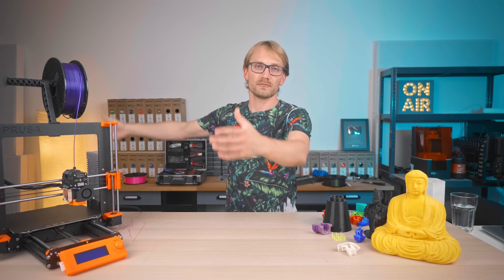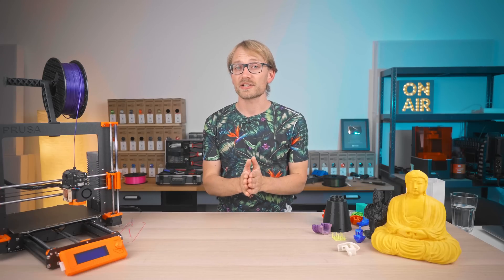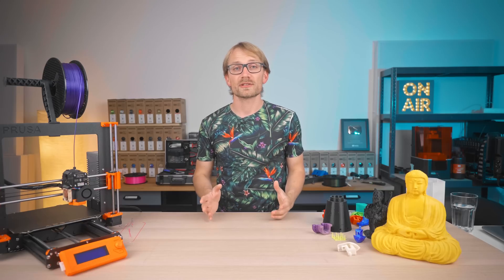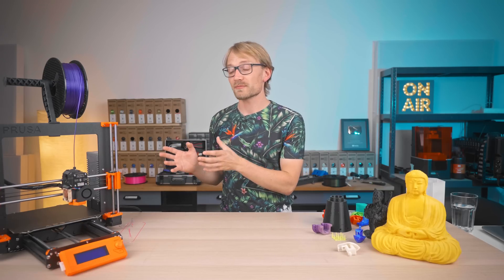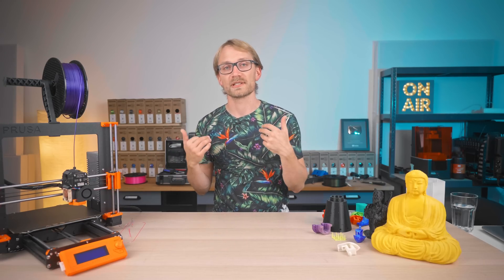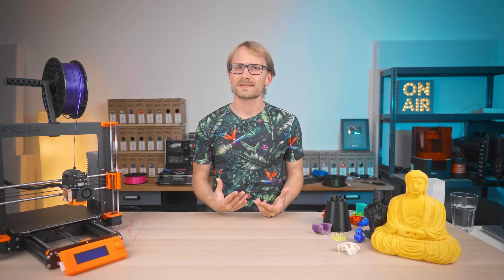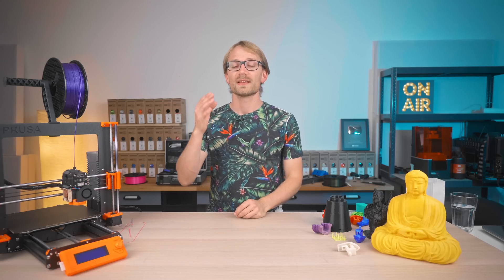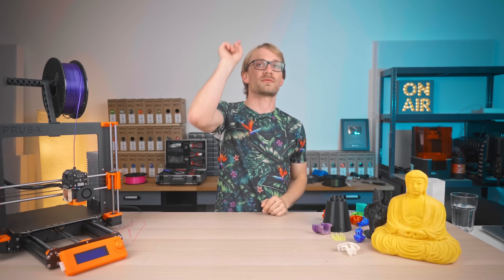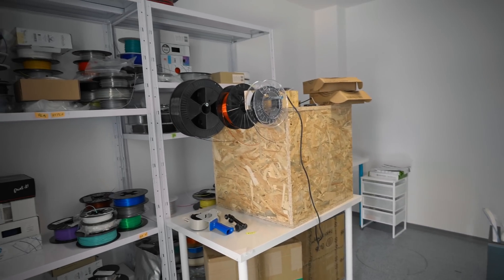For other noise, you can use a box, but for a lot of printers I still wouldn't want to have it sitting next to me on my desk — and that's not just because of noise, but also because of smell and the particles printers emit. There is some research that suggests that filament printers emit a considerable amount of particles, even when printing PLA. I don't know exactly how harmful those particles are, but filaments like PLA, ABS and Nylon are ones you can definitely smell and their fragrance isn't always particularly pleasant. Between the noise and the smell, I've relegated my working printers to their own little room — right now it doesn't have any ventilation in there, it should, but it's got a door I can close and not worry about it.